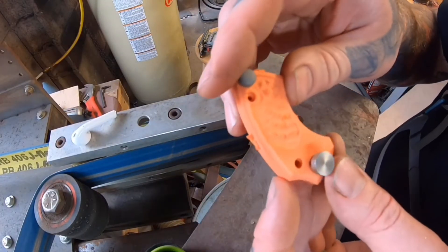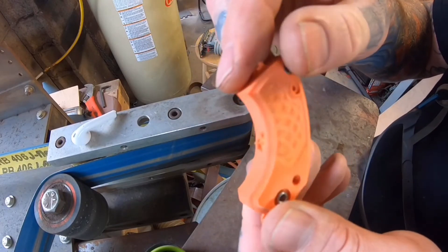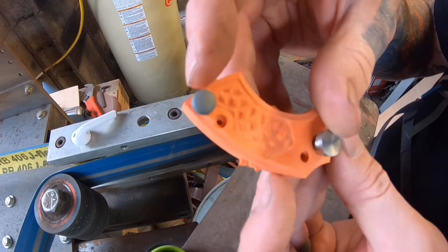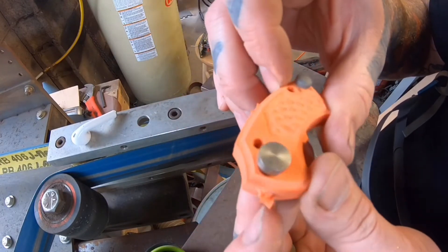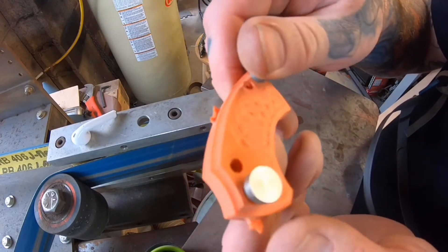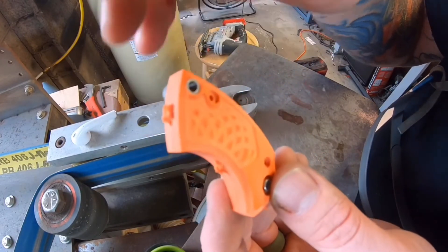Here's what I was talking about — I've got two random pivots through the handles, which keeps them together so I can profile off the tabs and around the edges, eliminating any hot spots. I'll do that to all of these guys and then get them soaking in some oil.